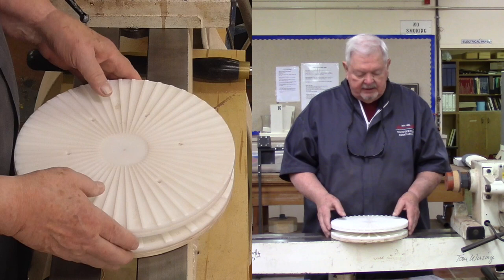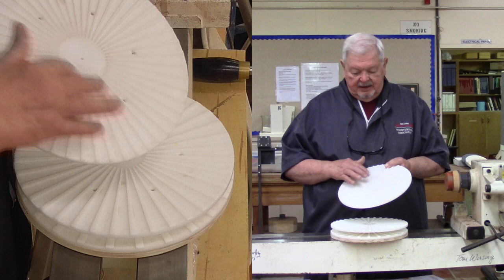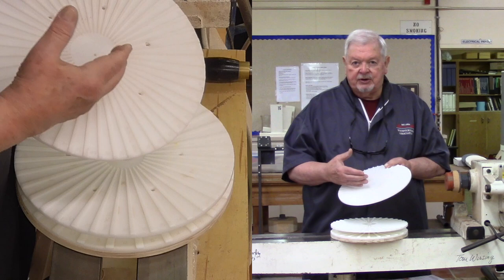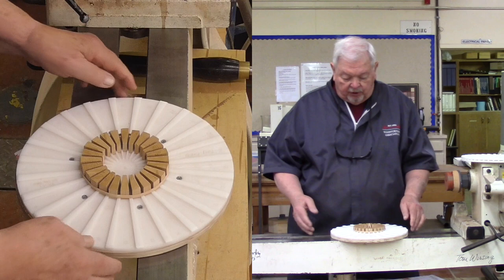And this is a technique using what are called Seg Easy plates. And there are a number of different ones. This plate will allow you to put 48 segments into these wedges with the proper spacing. It says it's a 48-2, which means that 2 degrees are taken out of the necessary included angle. There's a whole bunch of different sizes. There's a 36, in which 3 degrees are taken out, and a 24, which I have set up properly here.